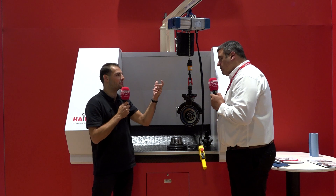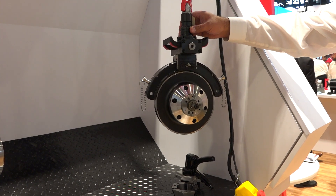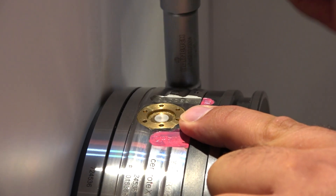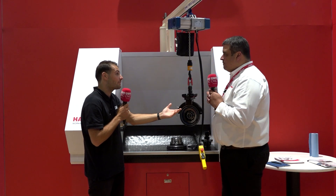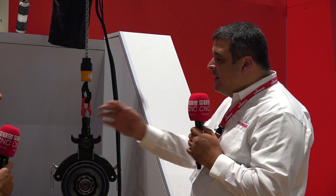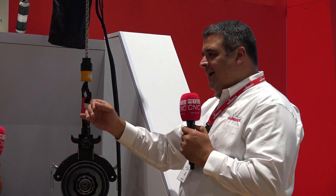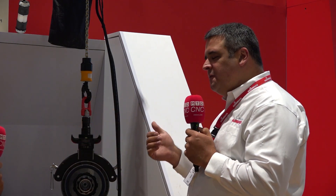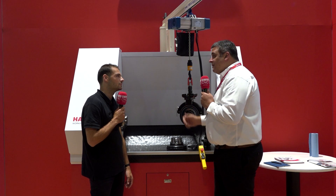Brilliant. And also the fact that indicating — for all the UK viewers here, that's like clocking something up, dial test indicating — means you don't have to, once you've changed this work holding, not only is it faster, you don't have to spend extra time as part of that set-up time clocking your whole part up, which might also take about five or ten minutes. Absolutely. Indicating a work holding is such a big part of the installation that, in addition to having to handle the work holding to install it onto the spindle face, the second part is getting it accurately set for your components. So when you remove that requirement from the installation, it just helps the practicality of the system altogether.